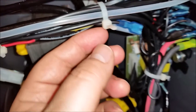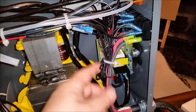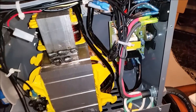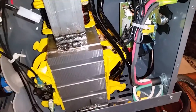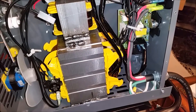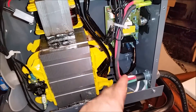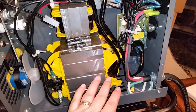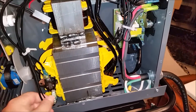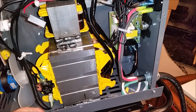Some people use sewing needle pins for that — it works. Or if you just have extras, cut those ones off and put new ones on. We put them back on there. That's it for now until we get to the other part of the video where I hook on the power connector and get the argon system on. For the power cable upgrade — the 10-gauge — this pretty much finishes the inside portion, until we get the piggybacks in and upgrade the rest of it.